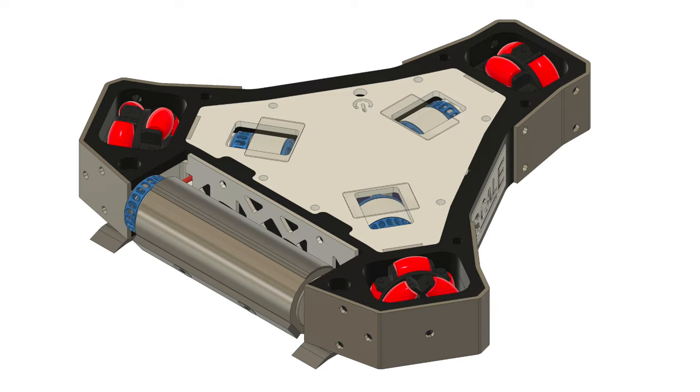Around this time, I realised that it would look really, really cool to have the drivetrain motors be the same ones as the weapon motor and have them stick out the top and bottom in cutouts. It's not a very good decision competitively, but it's not one I regret either. It looks very sick. The really big motors help drive later on, and they actually haven't been hit in the time that I've been competing them at all. This also included a move to 25mm Chinese spur gearboxes, also quite affordable.